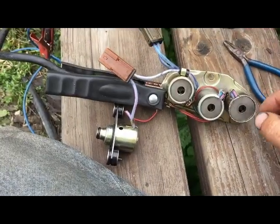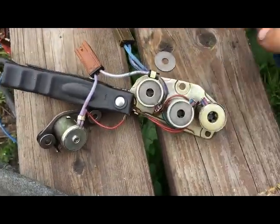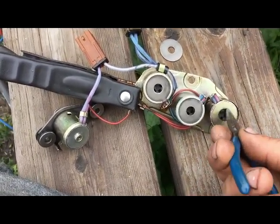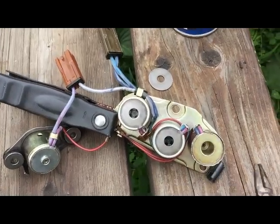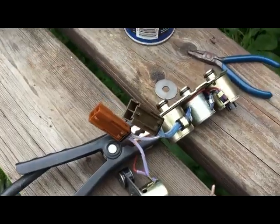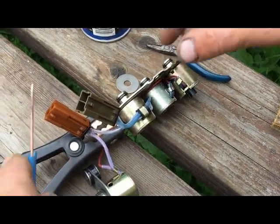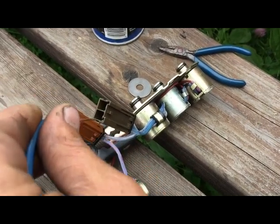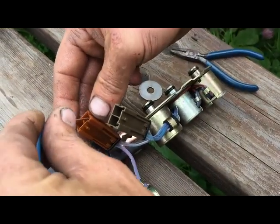So we unwrap this — you can see the ledge right there — then we pull off the washer, and I can use this in here to pull out the piston. You see how that just drops down? There's no spring inside of this hole. So without a spring you will not get this thing to cycle. What we're gonna see here is this piston is just gonna go one direction and it's not going to go back.